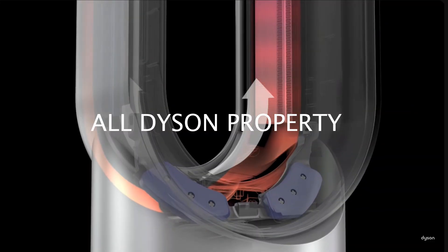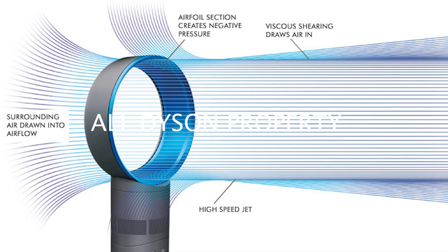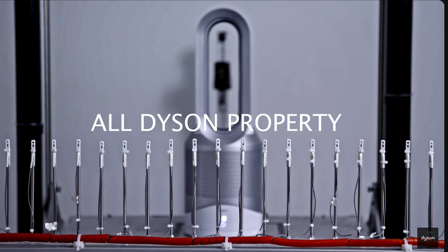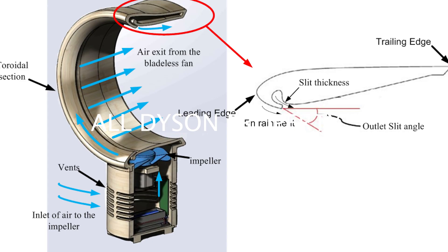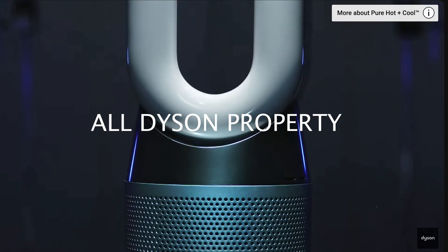There are plenty of resources online and plenty of good YouTube videos that go into depth with this. Basically, the airstream is indirectly generated by a separate fan unit. This unit can incorporate things like filters and ducts to make cleaner and quieter air, and then the stream from the unit is injected into this airfoil shape. The geometry of the airfoil causes a pressure differential, which both accelerates the air outward and pulls air inward upstream. Dyson has figured out how to make these effects work really well with each other and produce really incredible fans that generate a huge amount of moving air with no visible moving parts.